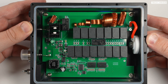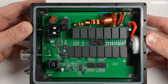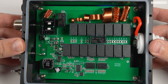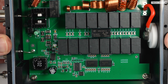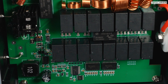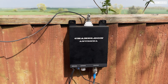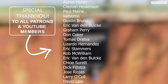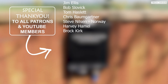I do want to try and get it working on 160 meters — around 1.9 MHz. The table I showed earlier suggests I need around 17 meters of wire for a counterpoise, so I may need to try that in a portable location as I won't be able to run a straight counterpoise in my garden. I could try bending it around the garden to see if that makes any difference. Anyway, I hope you enjoyed that — let me know what you think in the comments below, and also if you use a remote tuner, let me know which model and how you get on with it. Thanks for watching — see you in the next video.